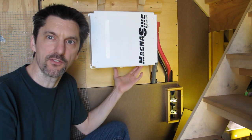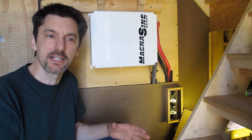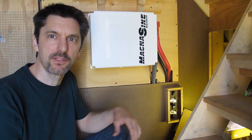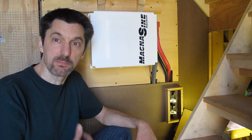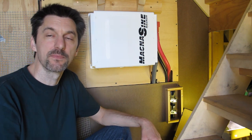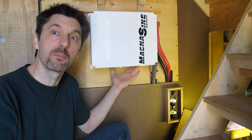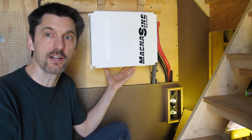This is also an upgrade — we have a Magnum sine wave inverter. A pure sine wave inverter is good when you're working with electronic equipment like digital clocks, computers, and laptops. It keeps the power at the correct wave. It's also helpful when you're starting up large motors — it can provide more watts at one time. They cost a little more, but they're well worth it. This is a 4,000-watt inverter. We replaced a 12-volt, 2,000-watt inverter with this 24-volt, 4,000-watt unit. This way, we can have more power, and it can also do 220 volts, although we don't have it wired that way.